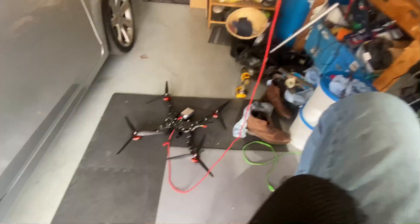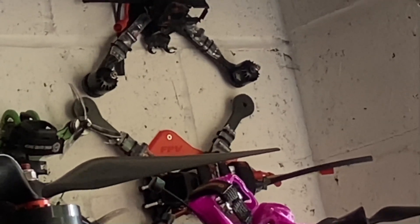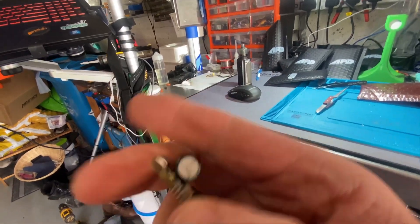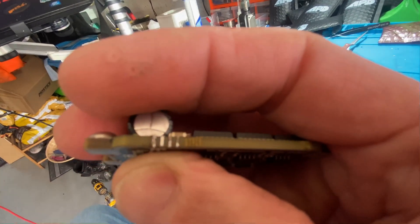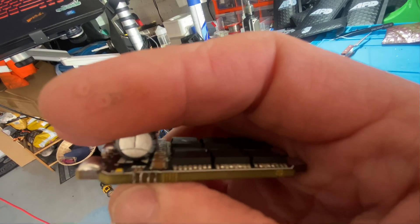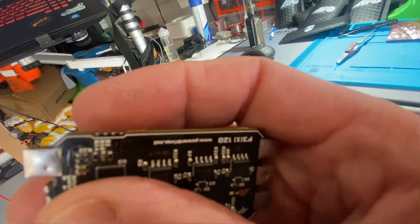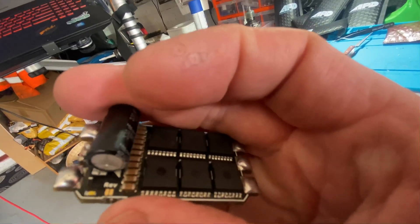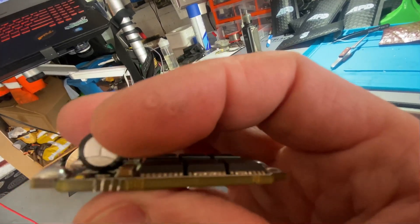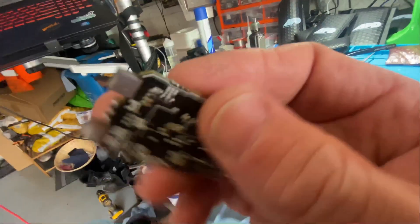So yeah, that's a quick look into the APDs and what you can do with them. That procedure — the 5 volt ground, TX to RX, RX to TX — is the same on the 80 amp ones also, they're a little bit more fiddly. But you've been warned: do not, under absolutely no circumstances, get those little UARTs too hot. Because if that tiny bit of copper separates from that PCB, you won't be flashing that ESC again. You can send them back to APD — they will repair them or replace them, sometimes free of charge. I did screw one up last year and they changed an 80 amp for me, which was good, but it's a hassle you can do without. So look into the APDs.